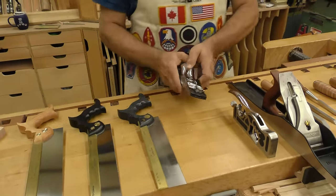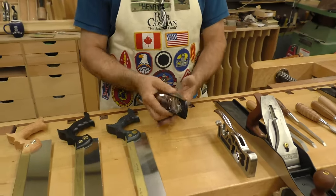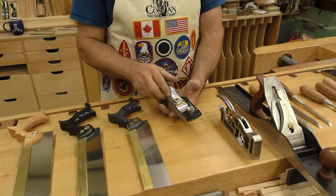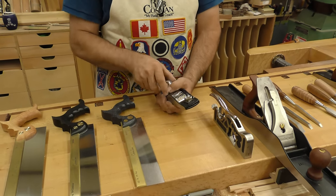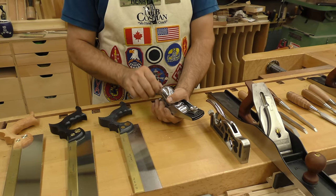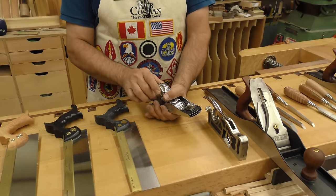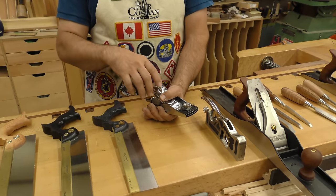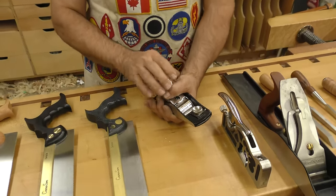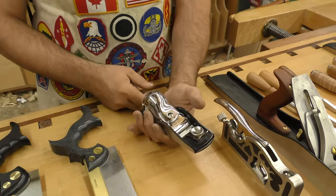Next is a block plane. This is a one-handed plane, and it's very difficult to cut a chamfer on something if you're trying to balance a big five-and-a-half. That's one of the areas where you really want a block plane — in this case, a low angle. I really like this style lever cap. When it comes to adjusting the blade, it's a lot easier to remove the tension first. On this one, you simply pop the lever cap but keep enough pressure on there that the parts don't fall out. You can make your adjustment, then snap the lever cap back into place, and you're good to go.